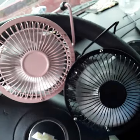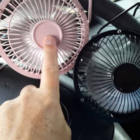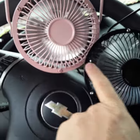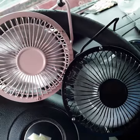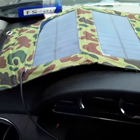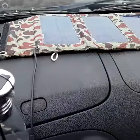The one from the truck stop cost me nine dollars and the one from the big box retail cost me six. The big box retail one is heavier but it takes a lot more voltage to run, so when the sun goes behind the clouds it stops. This one keeps running. So for my purposes I like the one from the truck stop even though it costs more - it runs on lower voltage.